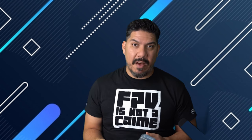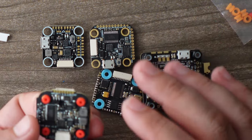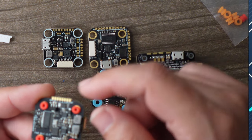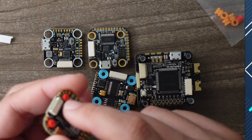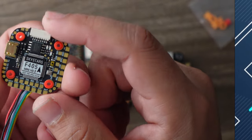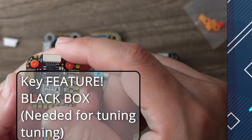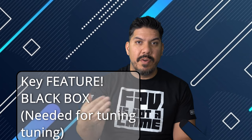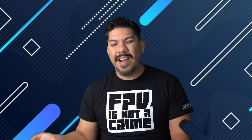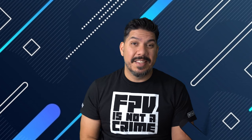Now let's talk about layout. If you're a person that likes big pads with fewer of them, or maybe the tinier pads with holes so you can insert your wire into them, you can make a selection based on that — it's mostly about ease of use during installation and personal preferences. Some key things I like: I like to have the camera pads towards the front of the flight controller, because that's where your camera is going to go. Sometimes the video transmitter is also on the front side, so your whole video system is up front and your receiver is on the side.